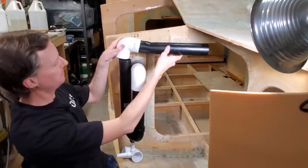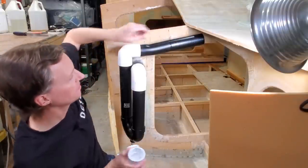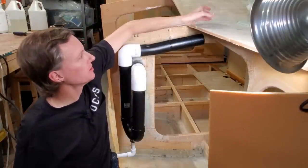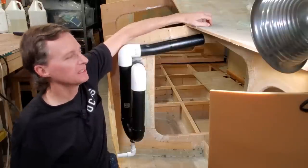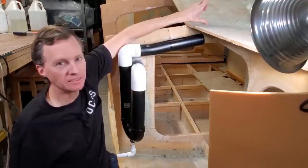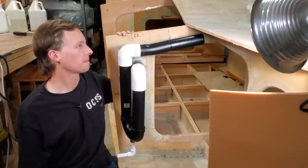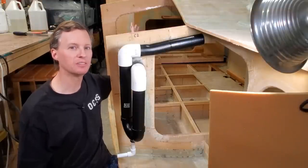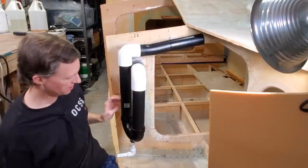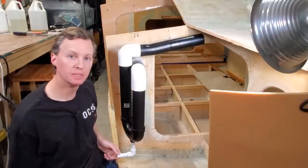You just saw me bend this piece up, so this is going to go on here and up to the deck. What I'm going to do next is bend this down a bit into this elbow fitting, then we'll have a piece going through the hole about here and the cowling will be on top. One of the good things is that this pipe will come above the deck six inches before it has its cowling piece, which helps if we have a breaking wave over the deck. And this is an exhaust cowling, so it's going to be facing away from the waves and wind mostly. So it shouldn't really scoop in a lot of water. But what water does come in will come down here and quickly drain out over the side, and this drain will be above the waterline.